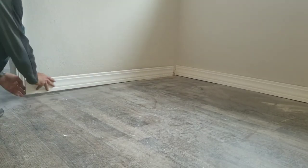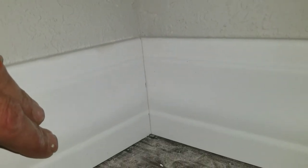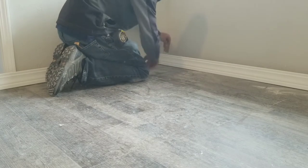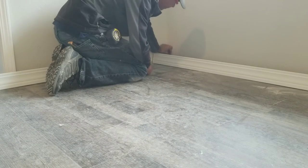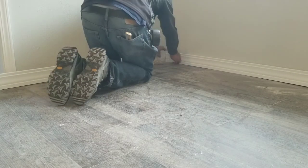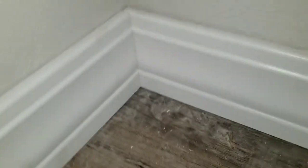Now hopefully you just slide right in — and done deal, there you go. Now let's say you're a little short over here. This is why I recommend not nailing off until you get a whole room done. If you have one a little bit short and want to tighten it up, just take a little cardboard shim or whatever shim you've got and throw that back there, then throw your piece in. Now you've got a small gap up at the top but that line is getting caulked anyway and you're never going to see it — you've still got a really clean cut.